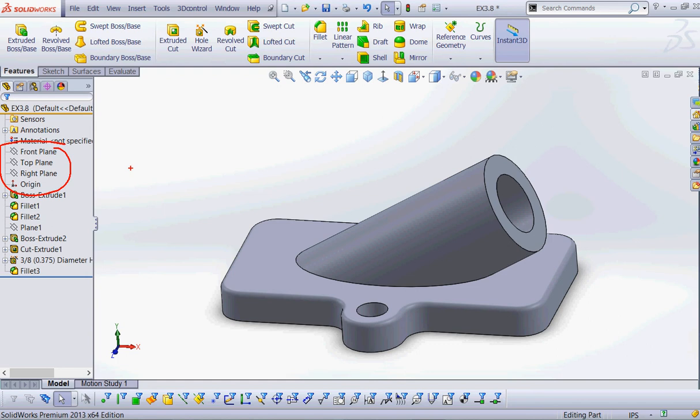So to see that, you would just look for the shaded lines. Right, so in this case, it's going to be ANSI inch. It's going to be a straight drilled hole, not a tapped hole. And these holes are 0.375. So I come over, I look for 3/8. There's a 3/8 hole, and they're going through all.